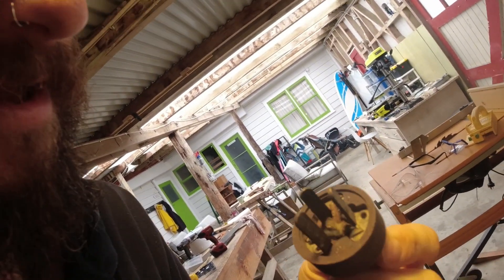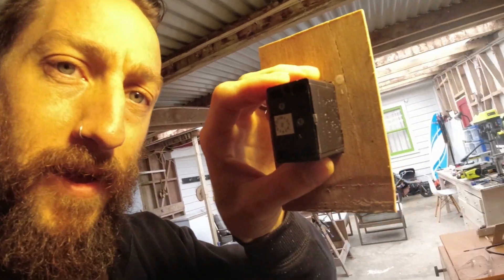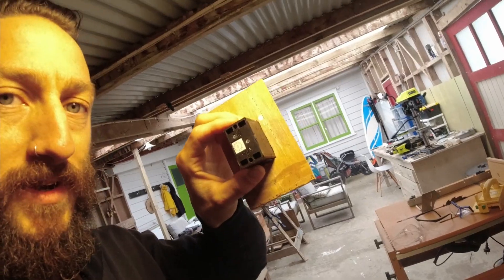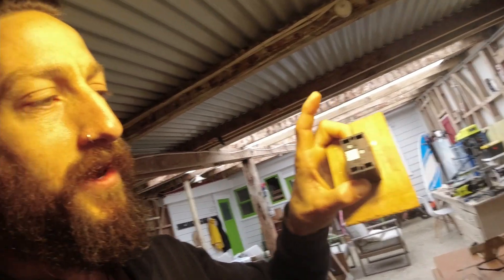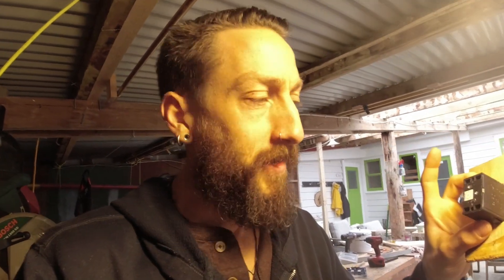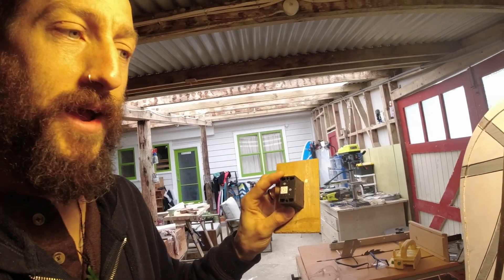You can see it looks like there's a green, a black, and a red wire. The way that this is going to work is we're going to have on one side of the back here — there's an in and there's an out. There will be a black wire in here and a black wire down here, and a red wire here and a red wire there. And the ground wire, which is green, we should not have to touch at all. It should just be running completely through without cutting it.